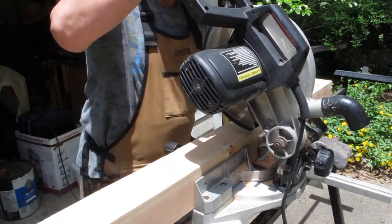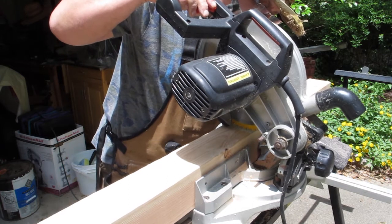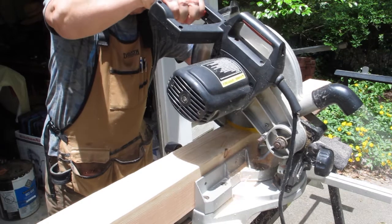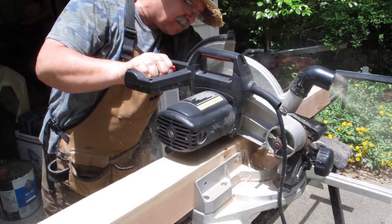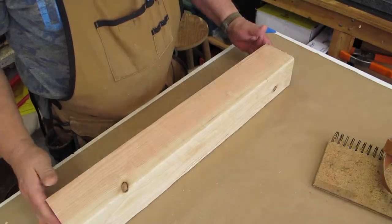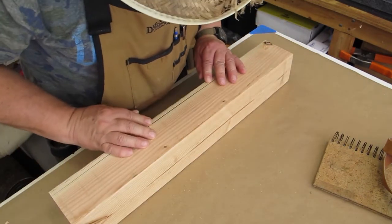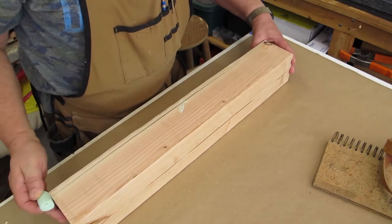I started this project by cutting down the 4x4 base. It's essentially made out of as clear a 4x4 pine as I could find, and the seat is a 1x12 southern yellow pine, which is clear. I had a hard time culling this material out of the big box store — a lot of it wasn't in the best condition. There's a split right here on this piece, but I went and glued that up.